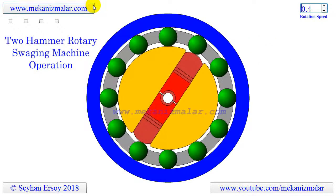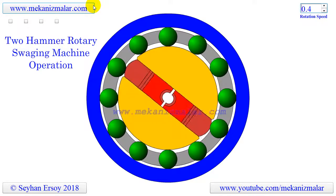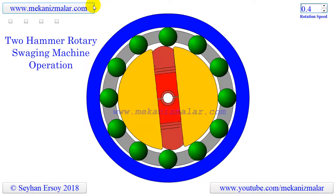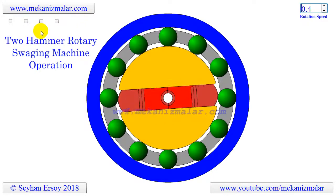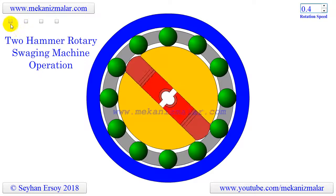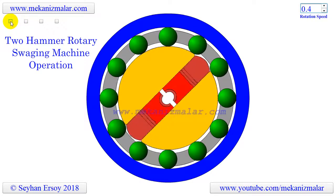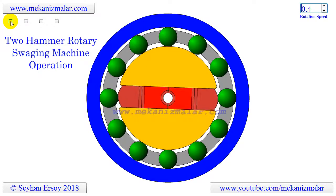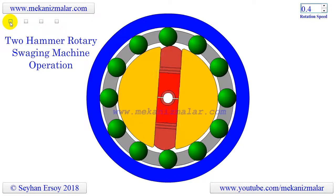Additional applications include optics, tool construction, welding and brazing devices, jewelry manufacture, metal joining and fixtures, and more. Swaging machines may also be used for other unlisted forming applications. Two hammer swaging machines are mainly used for light materials; when the material gets stronger, more powerful 3 and 4 hammer swaging machines are used to produce parts.